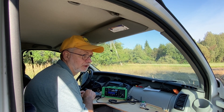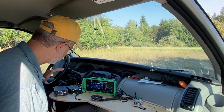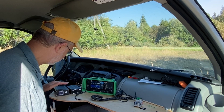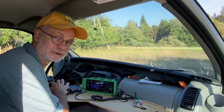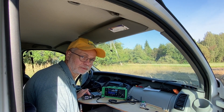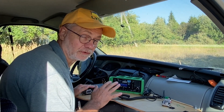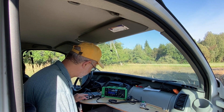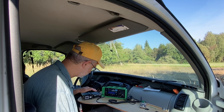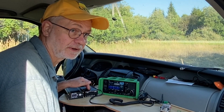If you do overload, you get distortions. There are plenty of different alarms, switches, and safeguards built in — automatic switches. When the power output reaches more than 50 watts, the computer built into the Micro PA50 automatically switches the amplifier off. The same goes with over SWR. And here, when it comes to SWR and the ability to work with an automatic antenna tuner, we have a problem.